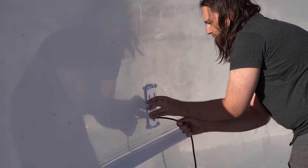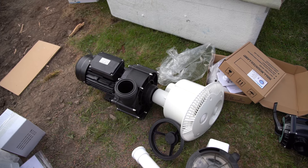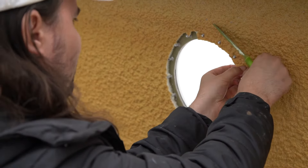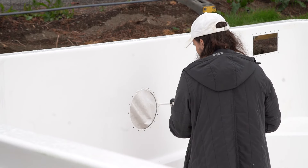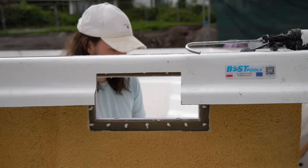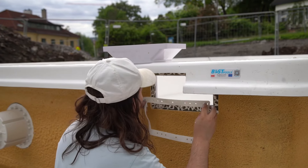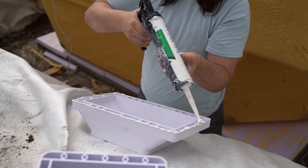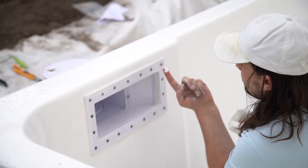Gently press the light to the wall and use a screwdriver to attach it, then finish it up by connecting an extension cable. For both counter current and skimmers we had to peel off some of the insulation in order to start assembling the parts. Tech7 is added to both sides of the pool, followed by a layer of rubber gasket, then tightening the parts with a screwdriver — and repeat the same order for the skimmers. Some people argue a rubber gasket alone is enough, but we want to minimize the risk of water leakage so we are not shy on the Tech7. Make sure to avoid spilling and clean up right after any overflow or accidents.